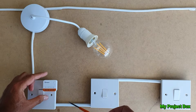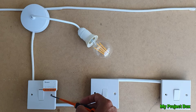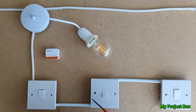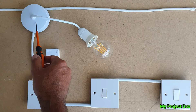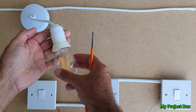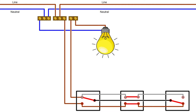Now you do need a neutral to connect your Sonoff Mini behind the light switch. In the UK it's not very common to have a neutral connection behind your light switch. But we have this loop-in junction box system where the live and neutral comes from the fuse board and loops into this junction box, then goes across to your next light fixture. So you have everything you need behind this little ceiling rose junction box to connect your Sonoff Mini. It's more than just a pendant to hang your light fixture — it's actually a junction box.